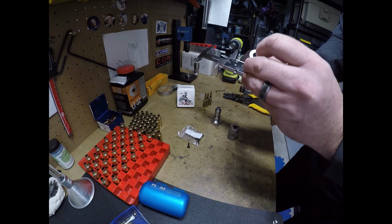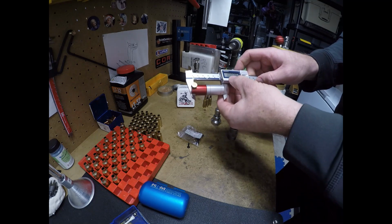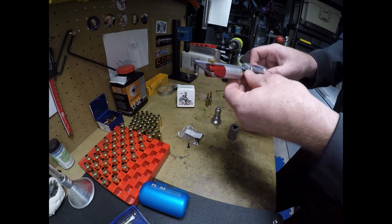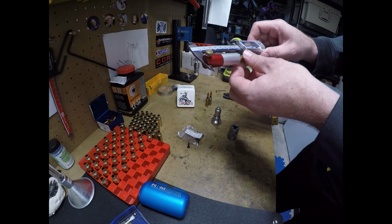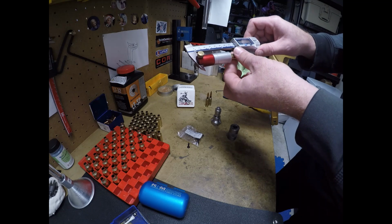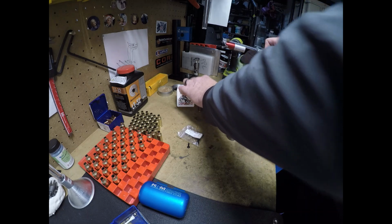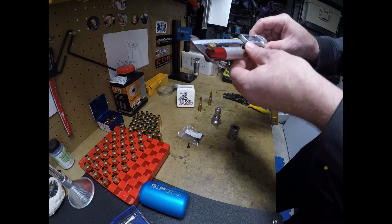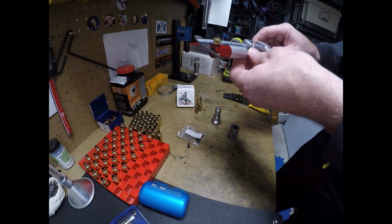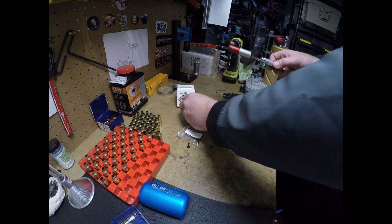You have to get the right size for the type of brass that you are using, and make sure those match up. Once you put the tool on, press 0 or origin or whatnot to zero it out. You take a piece of brass, bring it into the tool. Again, like the base to ogive measurement, rest it flush on the caliper and give it a little turn. Once it's very stable, which is stable here at 1.135, that's your measurement. Let's take another one. This one is 1.120. So I probably these different pieces of brass are from different chambers. 1.1195. Okay, so there you go. That's one way of getting your headspace measurement.